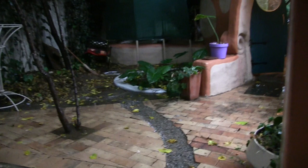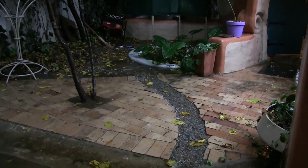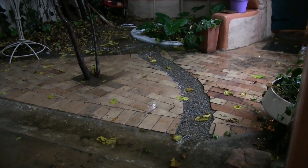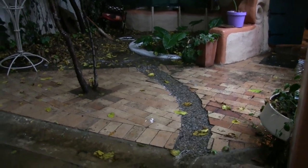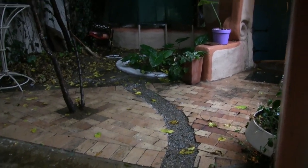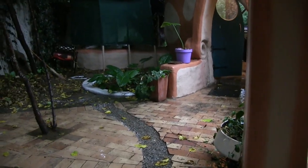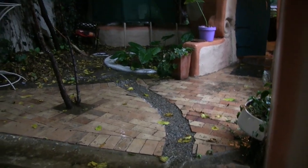Another thing - these trenches take water away, but not fast enough. The water backs up on the gravel, and we experienced it in our wetland. It's good for the wetland, but that's where the mistake was - cutting the liner too short because I didn't accommodate for the water backing up. Big rocks will allow the water to get out faster.